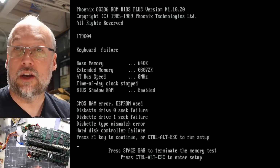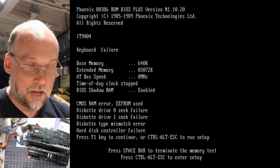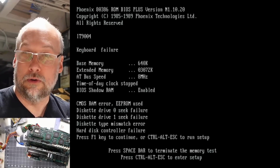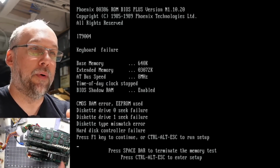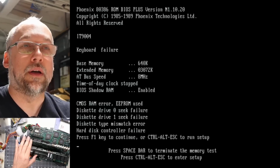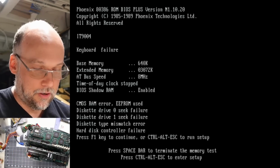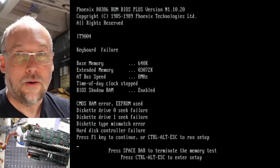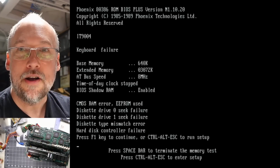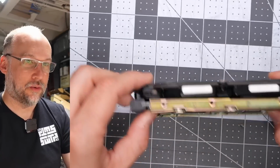and the same for the cards. Like the ROM on the VGA card can be shadowed into the main system memory once the system boots, and that has a huge performance boost on PCs. So that's why you lose that 384K. But with this card in there, we're getting an extra 2 megabytes of memory. It's just at a much slower 8 megahertz. Not ideal. But hey, thing was stored away in a box all those years ago, and look at that, Chad. Still works perfectly.